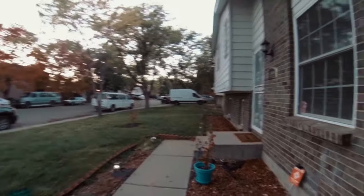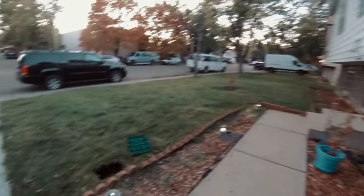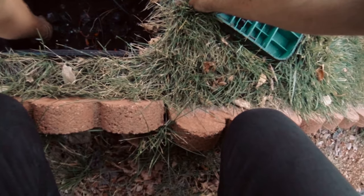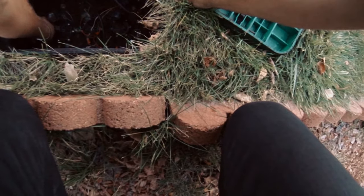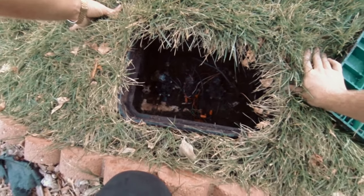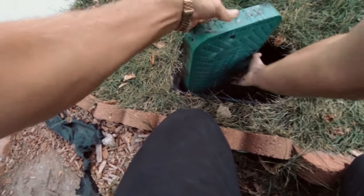Once you've finished your zones, you can go through a second time if you want. That's good enough for me. In here there's just a valve — I'm going to open this. It's a pressure release valve. If all else fails and this is open, it lets any water out. You open that little valve next to your solenoids and controller — that'll let any remaining water out. Then next summer when you turn them back on you have to close those back. Go to all your junction boxes and do this.